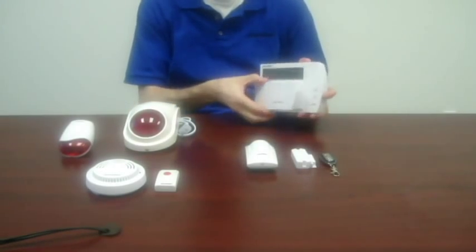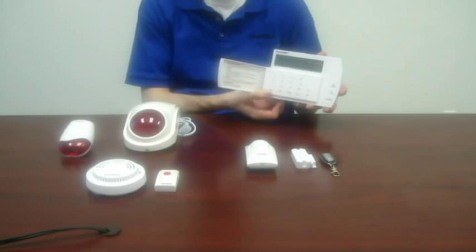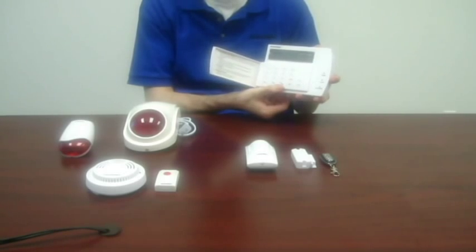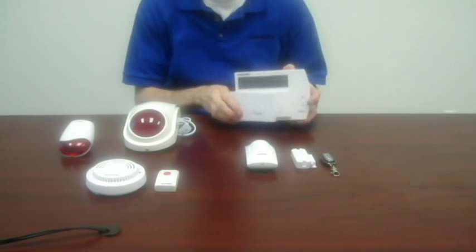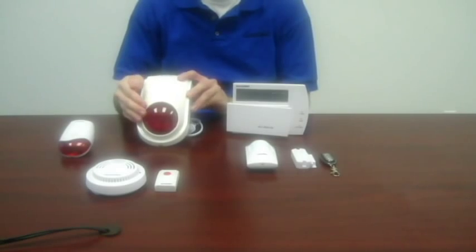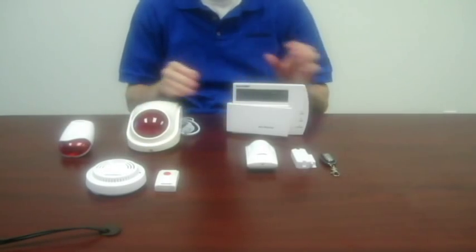After the button has been pressed, press the emergency button on your Air-Alarm1 host keypad. This will create the siren sound immediately. You can then disarm with Escape, your 3-digit password, and Enter, which in turn causes the outdoor siren to flash. This will indicate that it has been properly added into the Air-Alarm1 system.